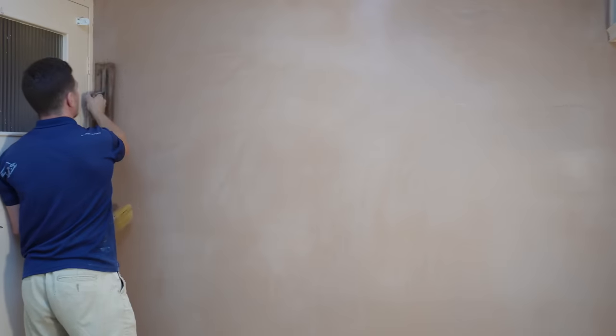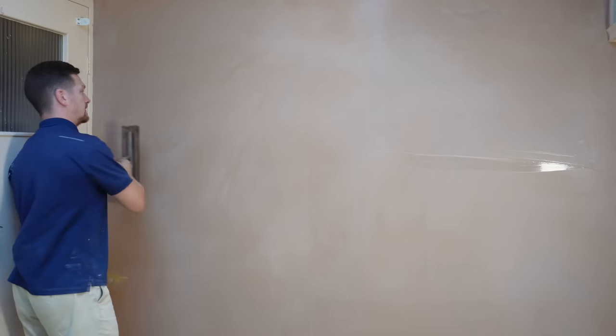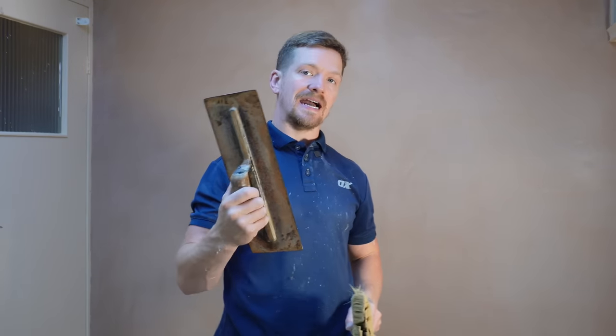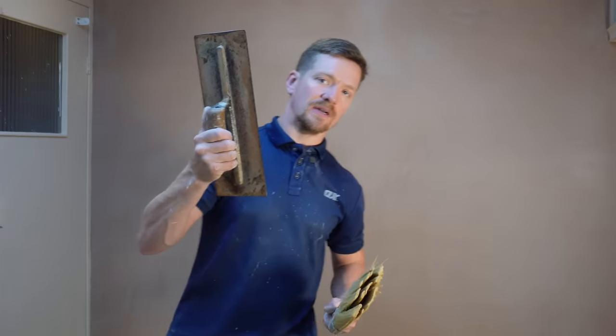It really doesn't need that strain of full water — I just use it a little bit on the edges and that is really enough. You could also use a flexi trowel for this part of the process, but I'm personally sticking to my carbon steel. I've spoken about it in other videos — I'm pretty much using this all the way through plastering at the moment. If you want to keep it simple, just stick to your base trowel; you don't need any flex, more than welcome just to use this all the way through.